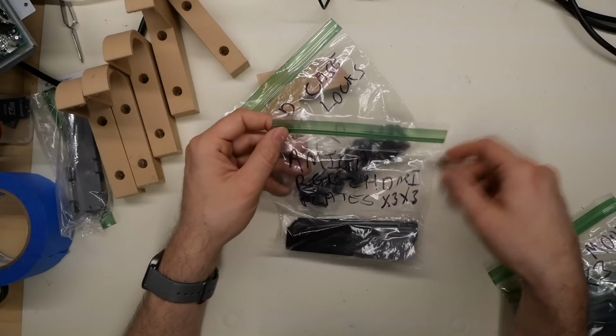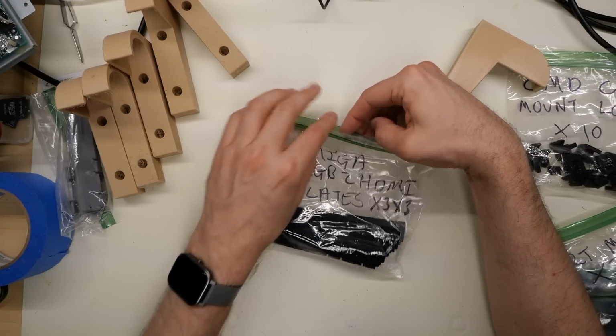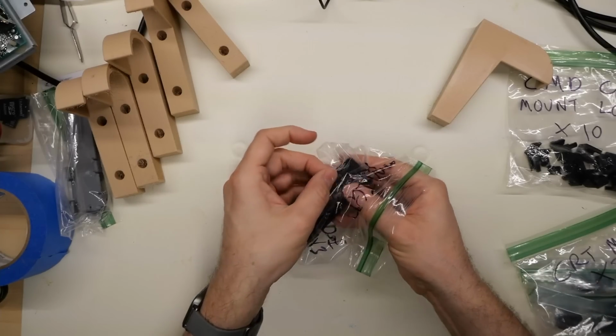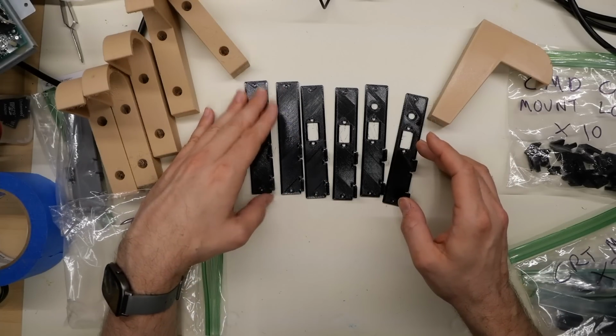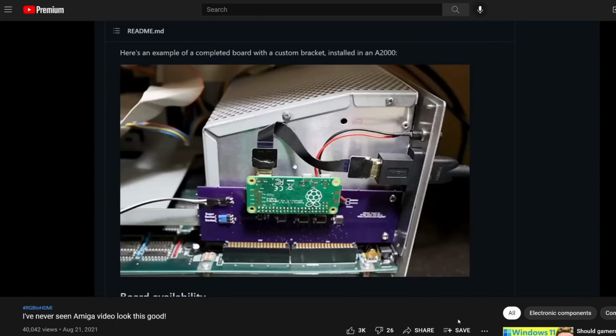And then what do we have here? Amiga RGB to HDMI plates, 3x3. Okay, so I had a video about the RGB to HDMI inside the Amiga 2000. I'll put a link in the description below to that video, but essentially it's a PCB that plugs into the video slot. There's a Raspberry Pi Zero on it, and it has an HDMI output of the Amiga video, and it looks amazingly perfect.